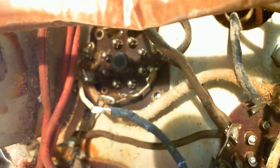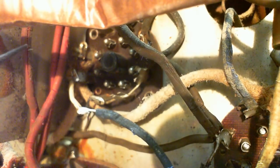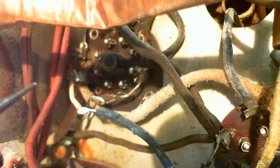Listen to that. Sounds as hard as can be. A little different. And these red ones over here, wow, the more I look, the more I see more and more problems. Look at this thing split here. If you get a big long split like that, it meets up with a couple of these radial cracks, and whole chunks of insulation can fall off without anybody doing anything. I did put power on this thing, didn't I? Wow. So she's not the healthiest.